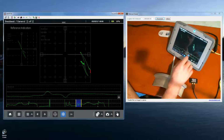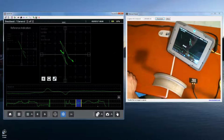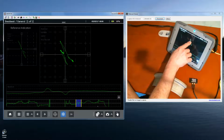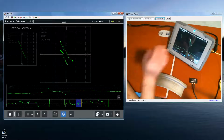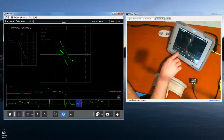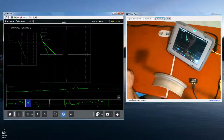the notch. However, what I can do as a video balance now, if I come up to the Lissajous and double tap, that triggers what's called a video balance. So the instrument will look at all of the data points that are in the selected area. So all of the data points in the Lissajous, it takes the average of the X and Y position for all of the data points, and it figures out what offset to apply to move that image to the center of the screen.